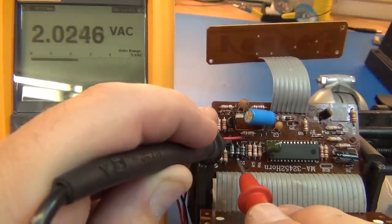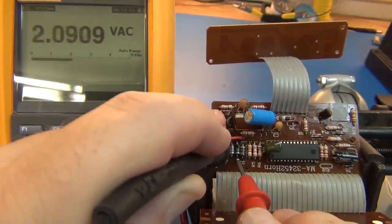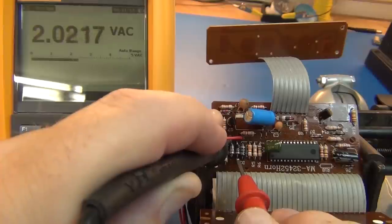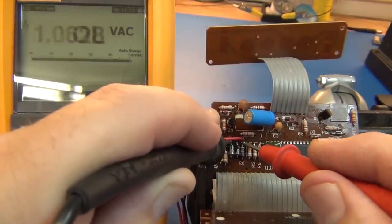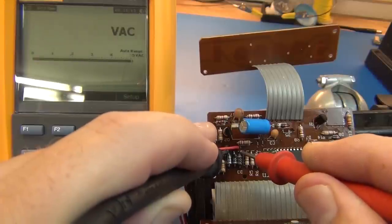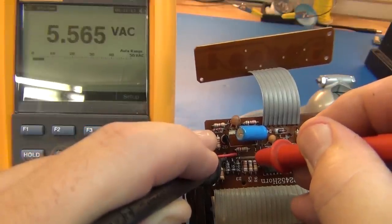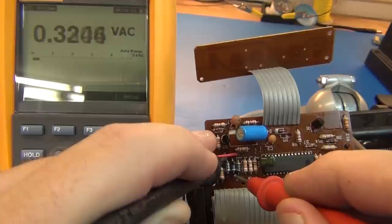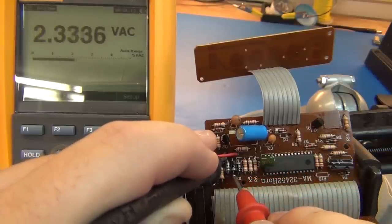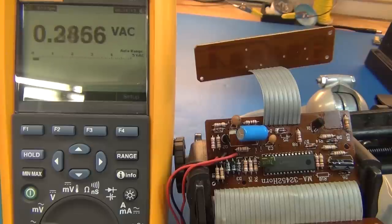That's interesting. It's only running 2. And that is definitely the other side. So why would one side be getting drawn down? This is 5 volts, and then the top of this one is where I traced out the other one. Yeah. Huh, 2.5. Well, maybe that's part of our problem. It's drawing down on one side and not the other. But it's good to know.